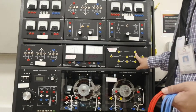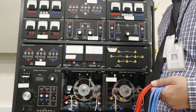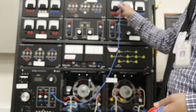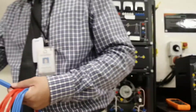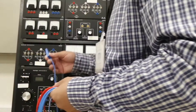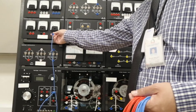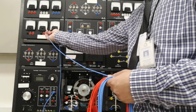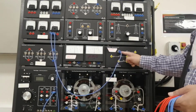Terminals 1 and 2 of the primary winding, through the DC ammeter. Connect terminal 7 to the DC ammeter — we are going to use the plus or minus 1.5 range. Connect it from number 7 to the 1.5 terminal. And the negative, connect it to terminal 1 of the transformer.